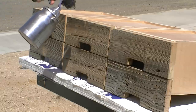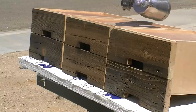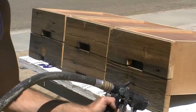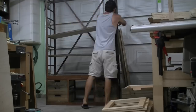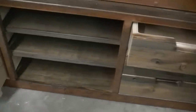Now it's time to spray on the finish. When the finish is dry, I give the drawers one final sanding with 320 grit paper, and it's time to put the unit together for the first time to have a look at all the hard work. The resulting bookshelf is a perfect addition to industrial style furniture in a home. The patinated metal surface and the bolt head accents, paired with the reclaimed wood's color and texture, give a unique element to this piece.